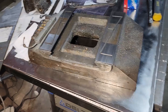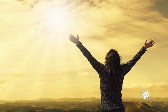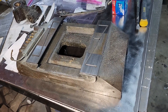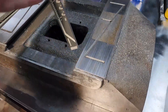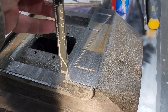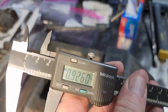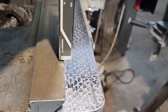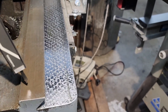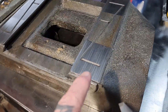The jury's out. I talked to H&W today — that is not going to get sent in to get re-ground. I'm going to have to put it back together the way it is. The reason why is that the knee does have to get sent in with this, and if it gets re-ground, the surface is going to become lower. It's going to wind up bottoming out on this. So he said it'll be fine to keep going like this.